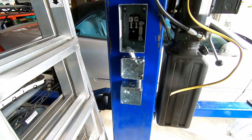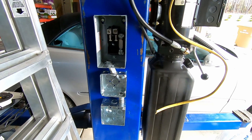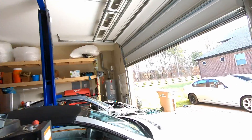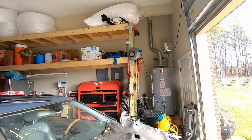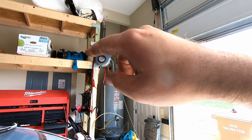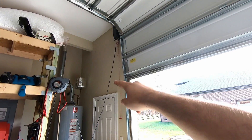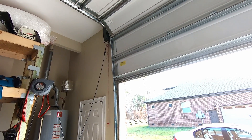The placeholders for the outlets and breaker box are installed. The next step is to run the conduits all the way to the top and route them around there. I'm gonna add one more circuit, one more breaker — I actually forgot to purchase it for the garage door lift, because it's still been wired with an extension cord since the moment I installed the lift. Hopefully we're gonna fix that today.